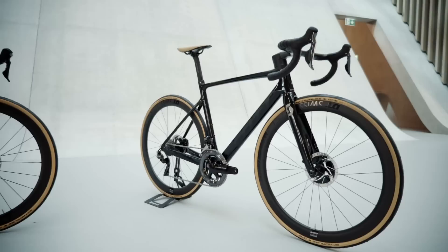When looking at the new Addict, when it came to the geometry, the goal was to make the bike ready for modern tire specs. The bike is specified with 28 millimeter tires on 21C rims. This opens up two challenges: first, you have to have enough clearance, but second, due to the bigger volume of the tires, the whole bicycle raises up a little bit.